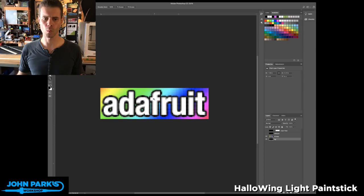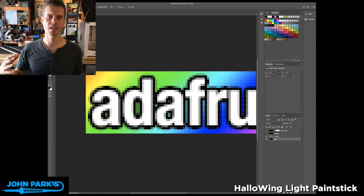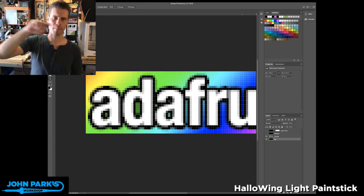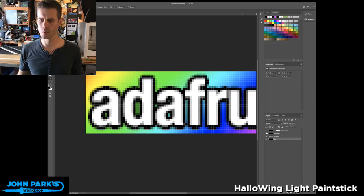So when we think about a single column of pixels that's being displayed on every time step, you can think of it almost like a TV set, a CRT, a cathode ray tube television set, turned on its side. So a CRT would rasterize vertically a line at a time, moving from top to bottom. And it actually did every odd line and then every even line, so it didn't feel like it was slow down at the bottom. So that's an interlaced rasterization of pixels that go horizontally. So this is a vertical version of that, and I have a couple ways you can look at this.